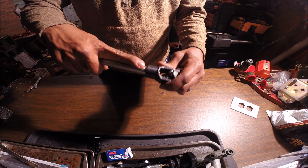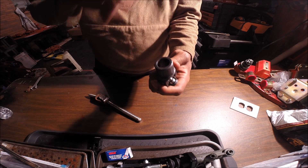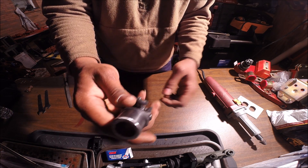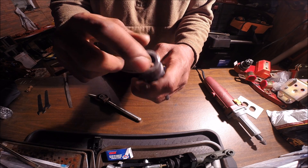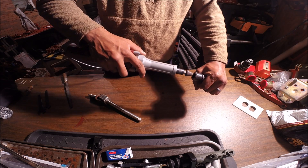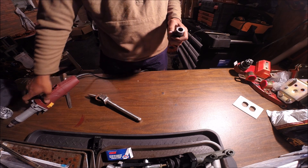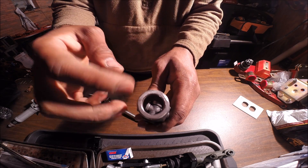Just as we had to clean the metal on this side, you're also going to want to clean the metal as much as you can on the U-joint side so that you get a good, clean weld. Fast forward — I went ahead and cleared this top surface and got it nice and clean. Now I want to go around on the inside of the surface with the die grinder, just to enhance my welding area. That gives us a nice bevel on the inside, which is going to give us more surface area to weld to.